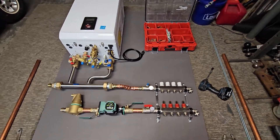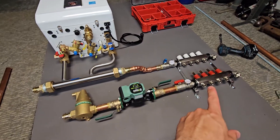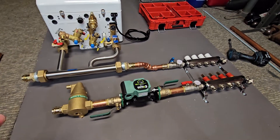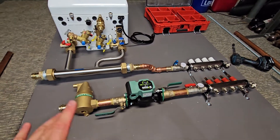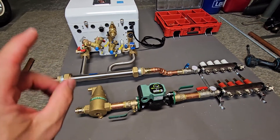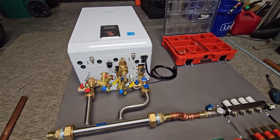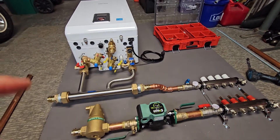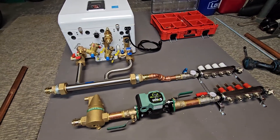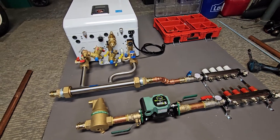This build is basically an in-floor heating boiler system. We have a manifold here that's good for four loops going into a concrete floor. This one's for an automotive shop — the guy has a couple of car lifts in there. This one includes domestic hot water, so this is a combi unit. It's a Navien 190-60. That'll provide 60,000 BTUs for the in-floor heat and 190,000 BTUs for the domestic hot water. He wanted the option to have domestic hot water to be able to wash cars and stuff.